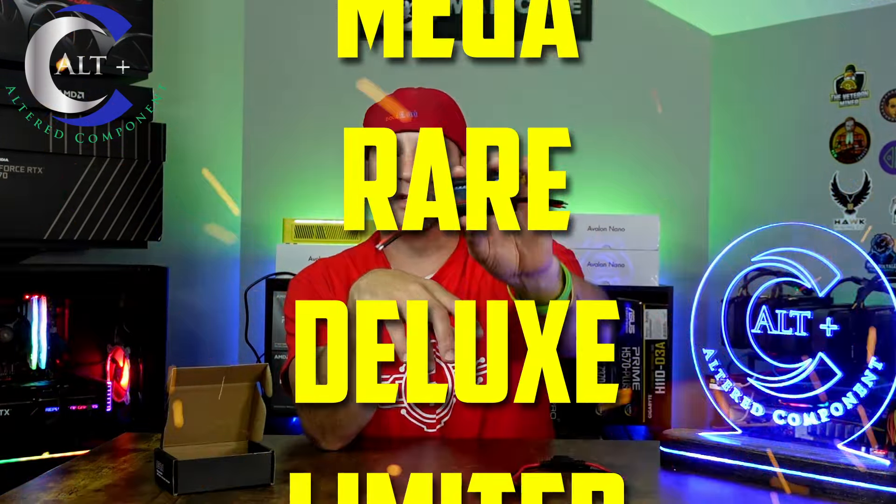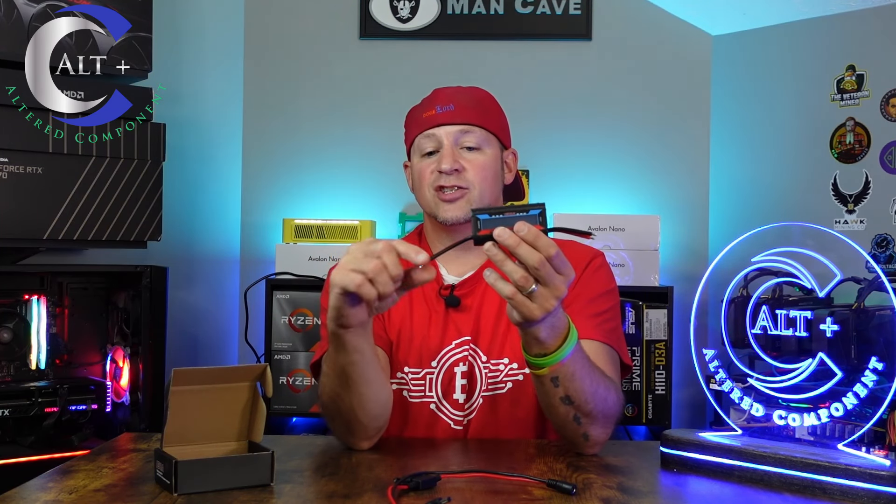Keep your eyes peeled for that one. So we picked up a nice 5.5 millimeter barrel plug — I picked this one up because we need a male and a female end, but it has an inline fuse. I'll chop that off and keep the fuse for another project since I'm not going to use it. I'm going to take both of these ends off. So our wall power, instead of going directly into our KSO Ultra, we'll plug it into the input side, then from the output side we'll plug into the KSO Ultra.